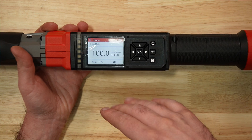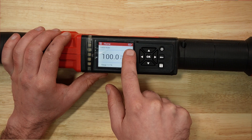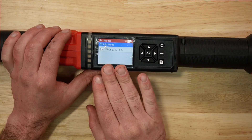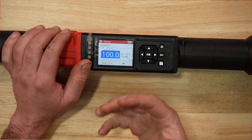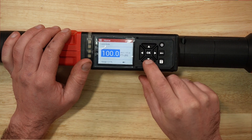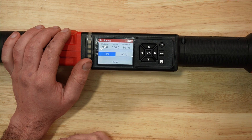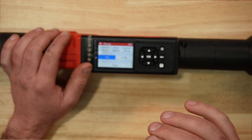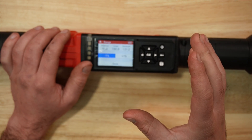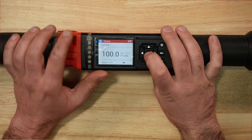At the top we have the menu, then battery indication. In quick mode you can store up to 15 modes. It's pretty simple — just hit OK, select it, and scroll as needed. Below that we have range; I've got it set at plus or minus one percent. This is not the accuracy of the torque wrench — it's the indication of what range you want to try to stay in. On the right we can look at data stored from previous torquing.